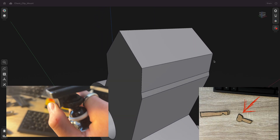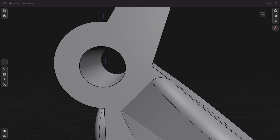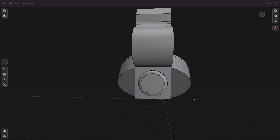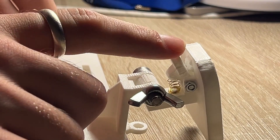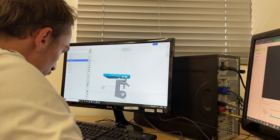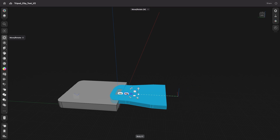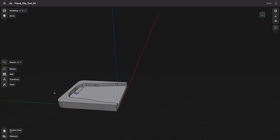This is the little sticky outie thing that goes into the underside of the plate. Here is the M3 screw hole to attach it to the greater receptacle. This knob is what will hold one side of the spring in place, and this thumb pad is what you'll push to move the lever, with a little divot taken out for ergonomics. Now for the main receptacle — I basically just created a big block and then subtracted the plate I made earlier from the inside to get the internal dimensions.